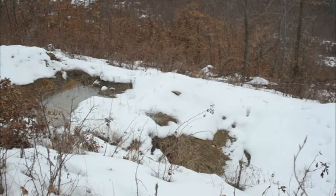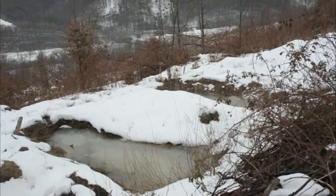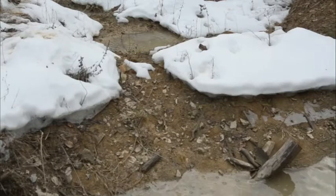If there were man-made slopes less than 2 meters high over the compacted soil areas, we ripped them to a depth of approximately 1 meter, so the water oozing from the capillaries could gradually infiltrate the decompacted soil in the slope and the dugout pits.